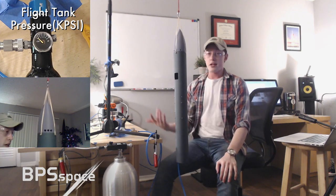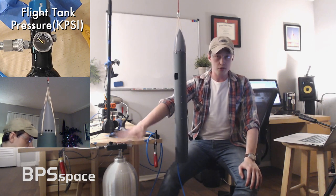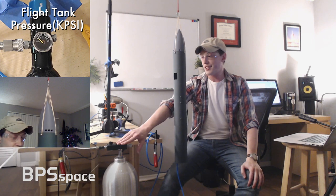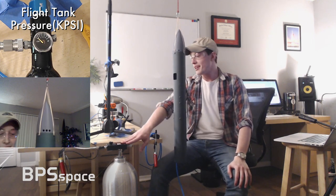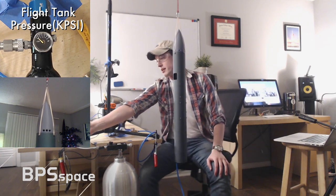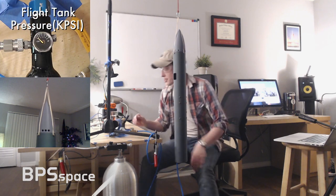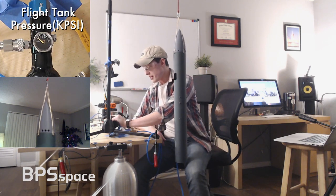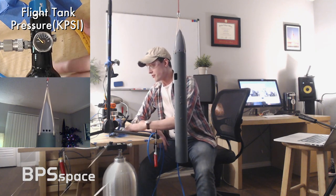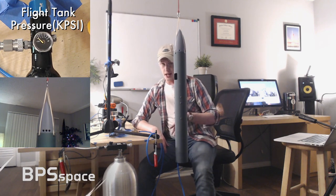Okay, here's the test procedure. Because all of the pressure is nominally held in this ground-side tank, we'll call it the GST, the ground-side tank, you can call it whatever you want. It's going to go through this, sometimes referred to as a whip or a fill whip, through this hose into the flight tank, and that's the start of our test process. We're going to pressurize the flight tank, and you'll hear some leaks begin to start, because there are even some leaks between the flight tank and the press valve. Again, it's okay for a test setup, it's not okay for flight.